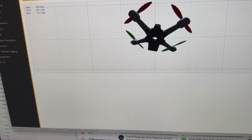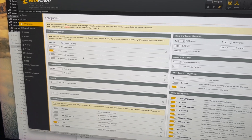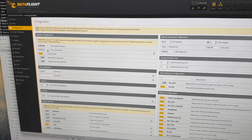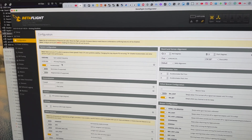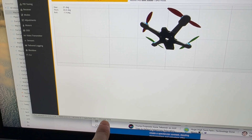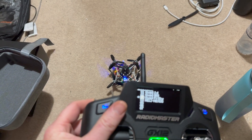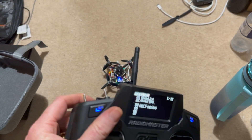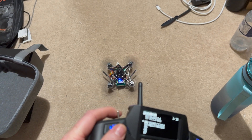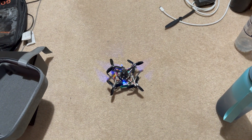I had to call it quits after flying that one quad that actually worked. Looking at the small quad in Betaflight, the CPU load is running at 62%, which is really high — it's on an 8K/8K loop. Dropping that down to 4K brings the load down to 32%, which is higher than ideal but still reasonable. A quick arm test — yay, it works! Great, but a little bit late.